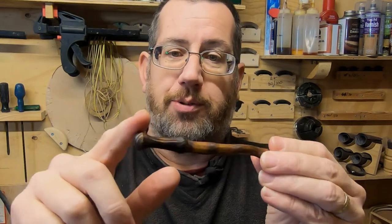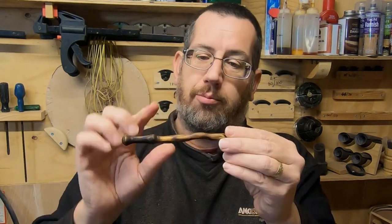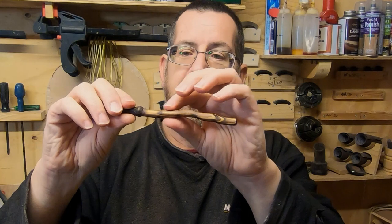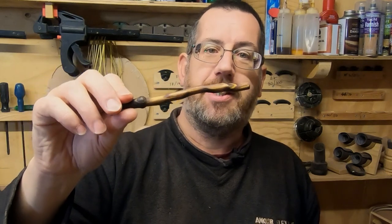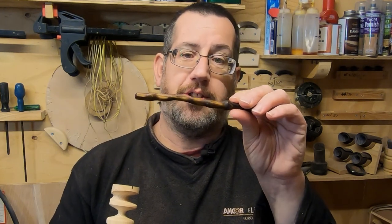I could have used the walnut crystals to darken up the handle but I just decided for speed it's quicker to burn it. Hopefully you can see on the ends as well where I parted off, sanded them nice and flat and then burnt the ends so they all tie in nicely. When you do the off-center turning like that you can get these little ridges and sort of more tear-out, so it does require a little bit more sanding to finish it off. I hope that's a good example - just doing gentle off-center turning. It's a bit uniform in equal lengths but hopefully that's a good example of how you can create more of a natural shape with off-center turning. Of course there's no reason not to do more extreme things, but hopefully it's just highlighted to you as a different option - something a bit more gentle on the off-center turning than the extremes. Thanks a lot for watching and I'll see you in the next project video.